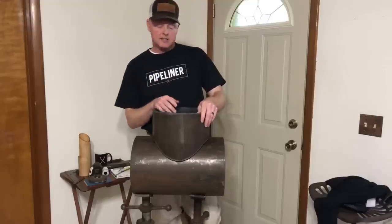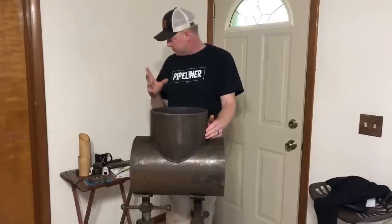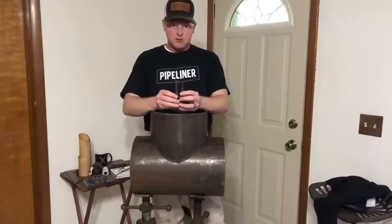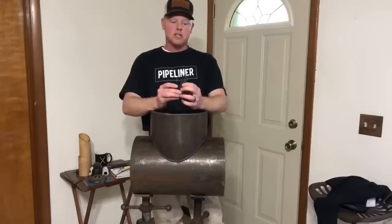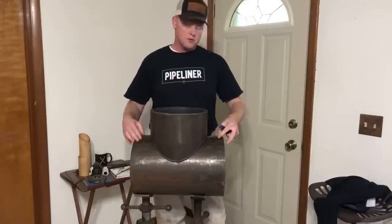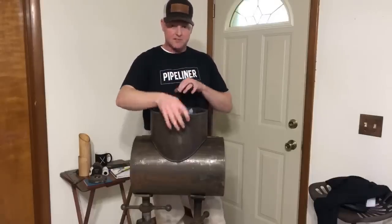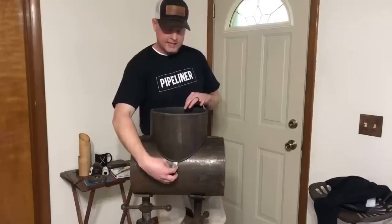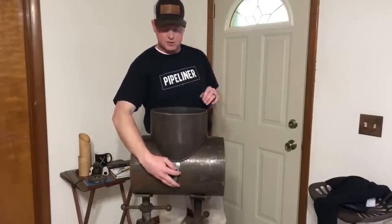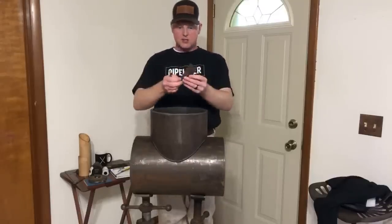My tip for spacing: I use three mini wedges. The guy who gave me my first pipe job told me to use these, and I've used them ever since. Put one in each of your two throats. Once it's fitting well and your hole is already cut, the branch will teeter back and forth — that's what the third wedge is for. Hang it where it's touching to adjust your ear gaps, tap that last wedge in just enough. Three mini wedges is my main spacing tip.